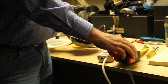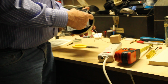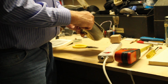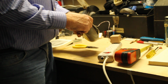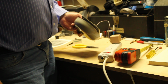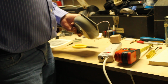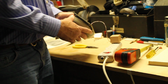So it has a coil that drives a plunger that basically goes back and forth and rings the bell. Inside you can also see that there is some other information on the bell. It says 18 volts, again it's AC, 60 hertz. You won't find 60 hertz in DC, don't even look. If you think that exists, don't buy this. 60 hertz, 0.325 A maximum, meaning maximum amps drawn from your transformer.